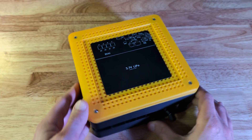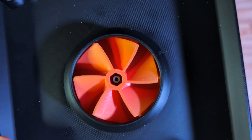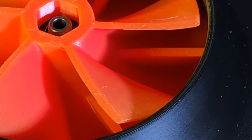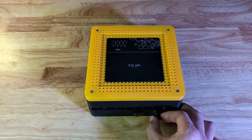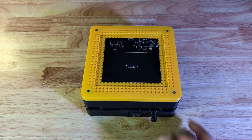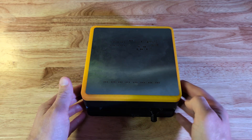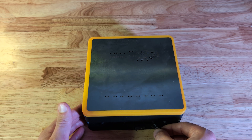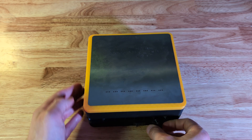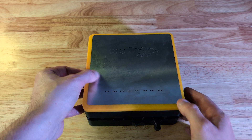All right, I'm pretty excited to test it out. That sound you hear when turning on is created by the ESC using the coils of the motor as a crude speaker — you can even see the impeller move a little when the melody plays. Oh, that's frightening, but there's a lot of air coming out so I'm hopeful it will actually create a strong enough vacuum. Oh yes, the stencil gets pulled down pretty quickly, which is much better than I was hoping for. Let's go full throttle — it's loud, but much quieter than it was without the stencil. The stencil seems to be held in place quite well; I can't really move it.